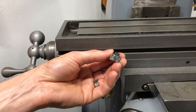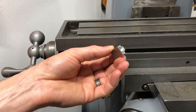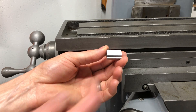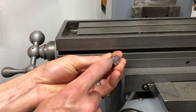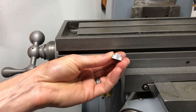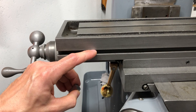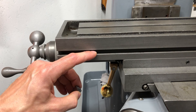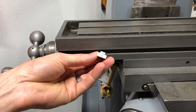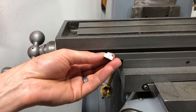I didn't explain exactly what I was doing for all of the steps while making this. Most of the dimensions didn't matter — the length and the depth of cut weren't that important. I just made the profile of the T so that it would fit nicely into the T-slot. This is sort of an odd dimension, 340-some odd thousandths — not a common nominal measurement — and I just took equal amounts off of both sides of the T until it fit nicely in there.